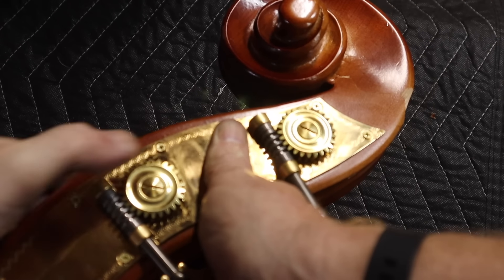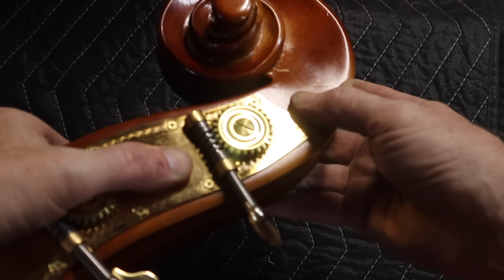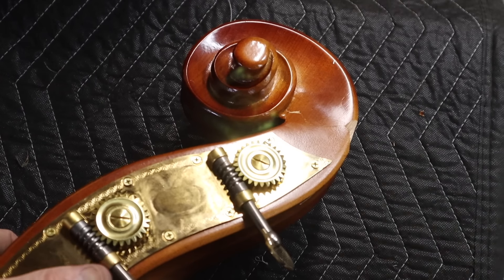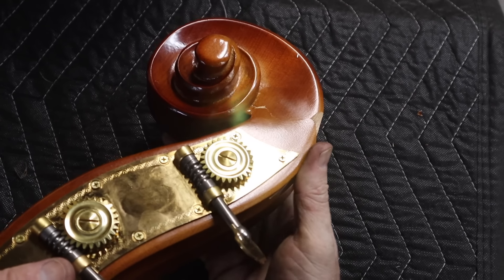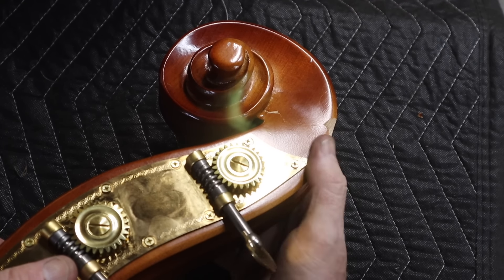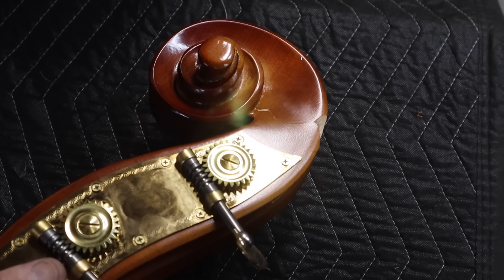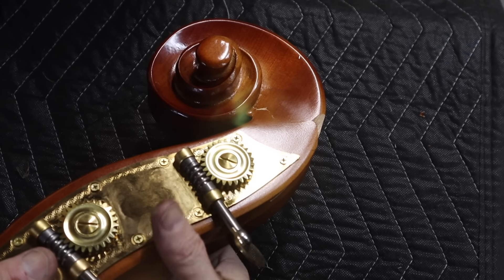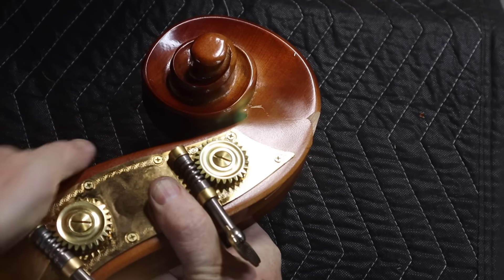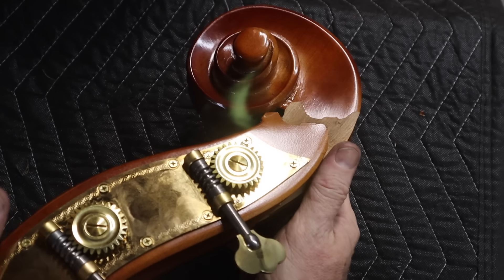You can see up here we've got a little bit of ugliness on the other side. If I go with the Kintsugi method, I think the best thing to do would be to literally dump a ton of wood glue in here, glue this thing up as-is, and then go in and make the rest of it look good. There's definitely enough wood making contact throughout to make it a safe, clean glue-up.